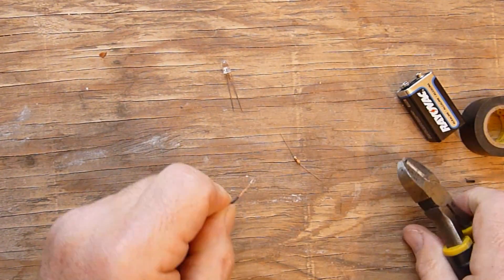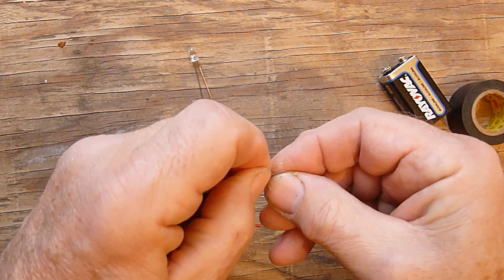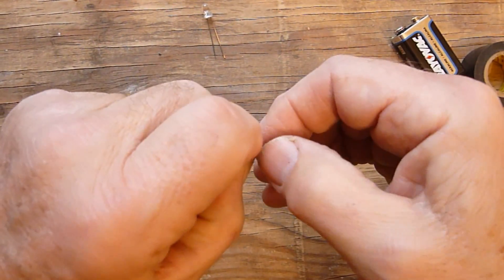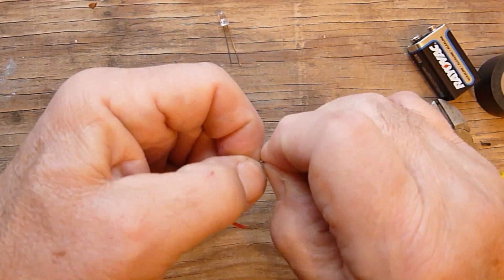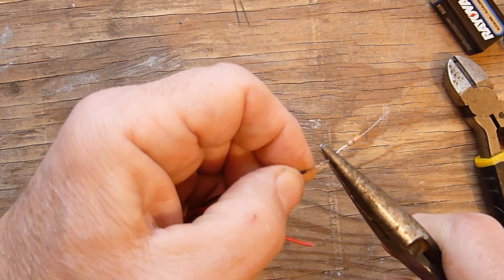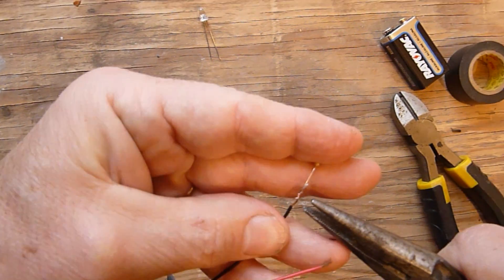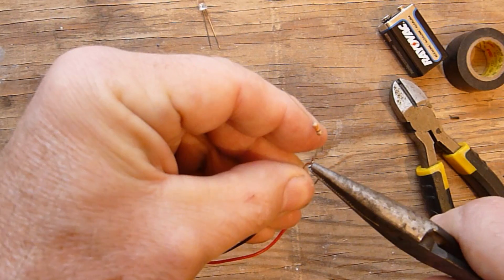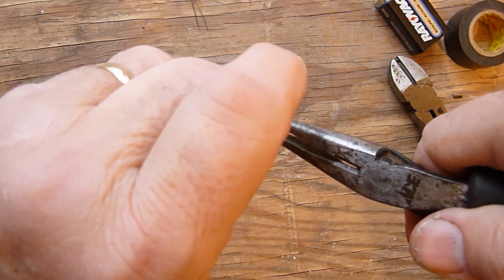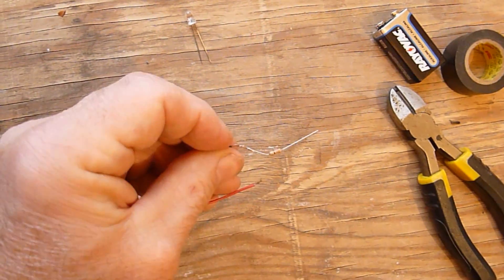In this case, we are trying to connect a resistor lead to the black wire that comes from the connector. We first remove the insulation with the side cutters. Then we use our fingers to twist the wires together nice and tight. Then we use long nose pliers to secure the connection and make a little hook where we can squeeze the wires together so they are more secure physically. We want to make a good physical connection and also a good electrical connection — both are extremely important, because if you don't have a good physical connection, they will just fall apart.